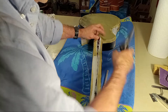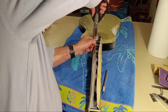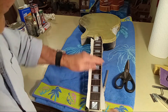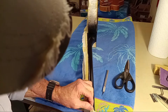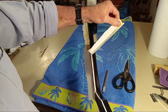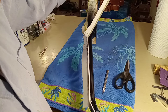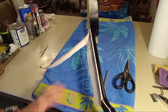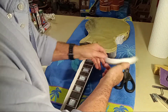On the left side we opened up our fretboard — no overspray, nice and clean. Now we're making a real clean pull. When I relieve tape I pull on about a 30 to 40 degree angle — roughly a 60 degree angle from how you're looking at it — and you're just watching to make certain your paint lets go cleanly. That line released very well, and that's another reason why I love working with lacquer.